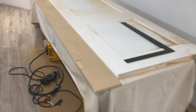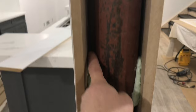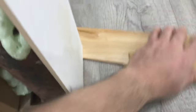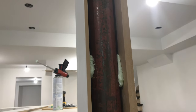I waited a couple hours for the foam to dry. While it was drying I was doing finished carpentry on this job — machining the jambs, cutting down the doors and stuff. It's pretty much dry now. Let's remove the shims and see what's going on. I know it's dry because I press on it and it's pretty hard. Don't do this while it's fresh because you'll need acetone to take it off.